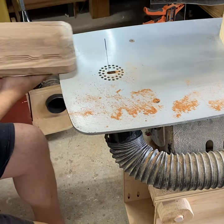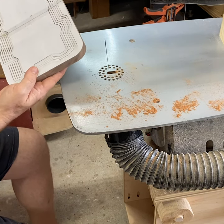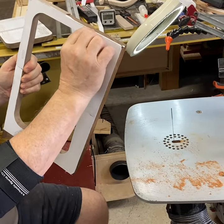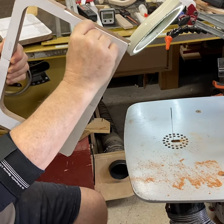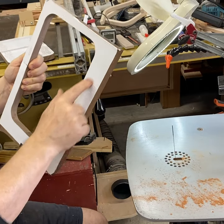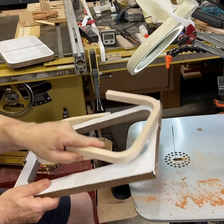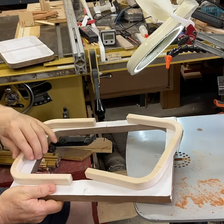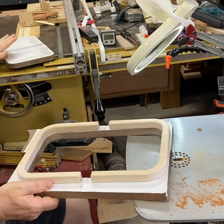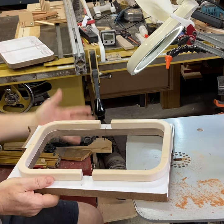When you're all done, there are all your sides. I save the outside one and make sure I leave enough material — that looks about right — and I draw a line around here and cut that perpendicular to make the handle. The handles will be cut out of this piece over here so that when I put the handles on the basket, the grain will line up and you essentially have one piece of wood.